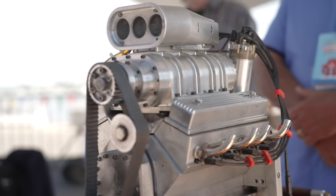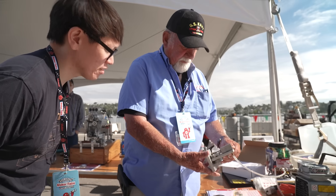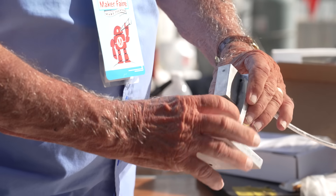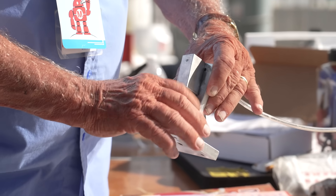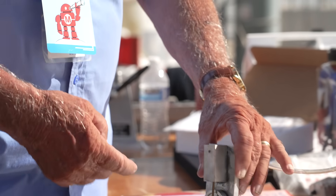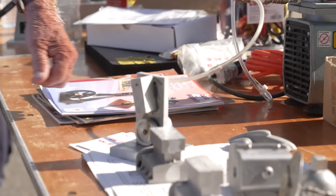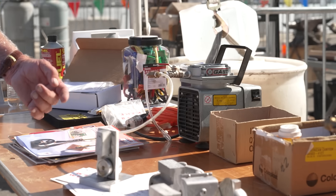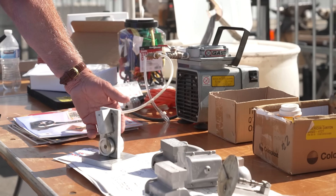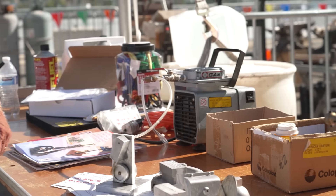Are there any favorite designs in the group? This is called a wobbler right here — this is basically a steam engine. You got a piston here, and you'll see there's a port here. As this rotates, driven by the piston, this would be the crankshaft. This would be your exhaust port, and then as you turn it around, it'll be the intake port. It's called a wobbler because it wobbles back and forth. That's your most basic motion — all the fundamental elements. It's got a piston, crankshaft, connecting rod, and a flywheel on the back, which is a little bit heavier than the crankshaft. So it keeps turning and it'll just run like that all day long. And those basic principles get scaled up.